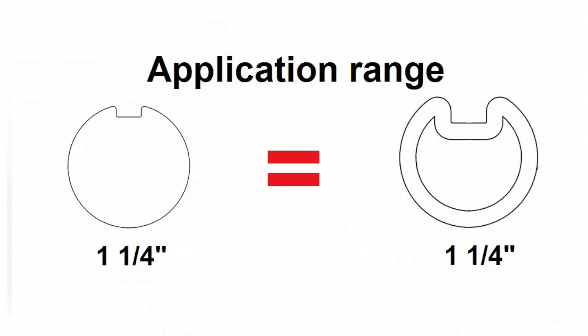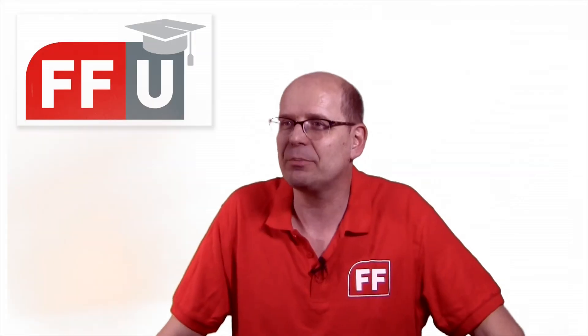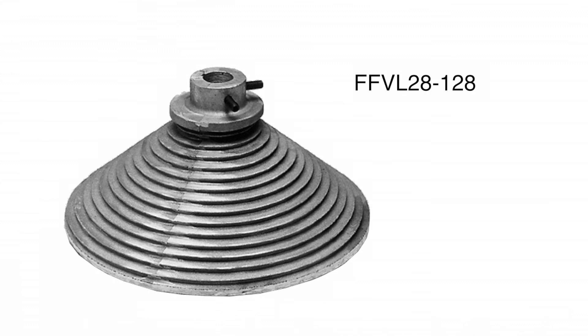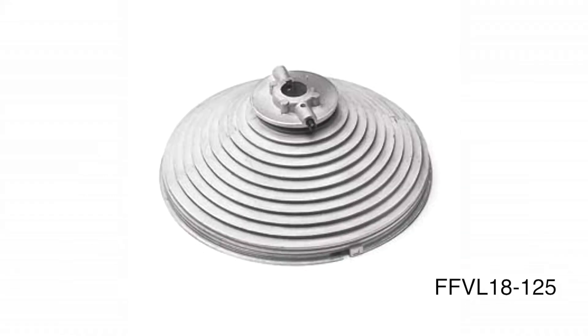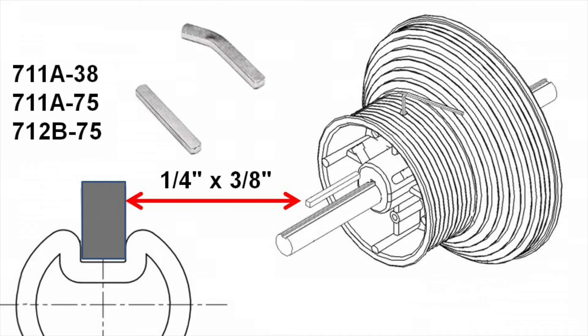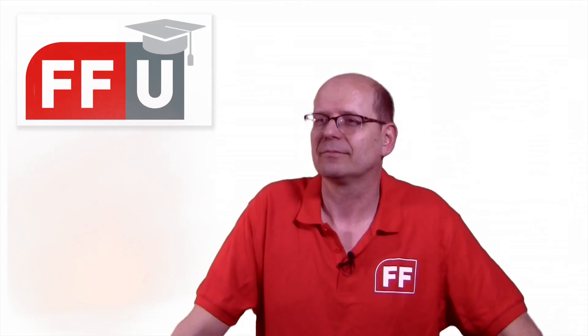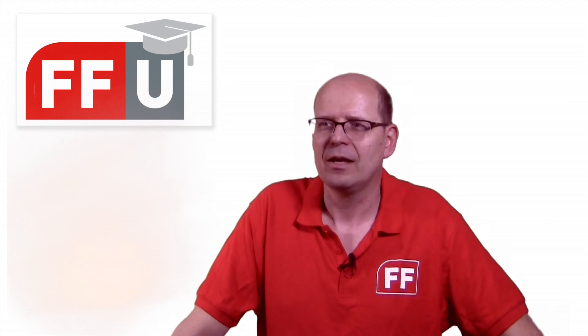To make it simple: the application range is equal to that of the solid one-and-a-quarter inch shaft for all drums with two safety windings, except for the vertical lift drum VL28, which goes to a maximum door weight of 575 kilograms. All drums, couplers, and spring fittings — no problem. Just use the right keys, because the keyway is bigger compared to the solid shaft keyway.